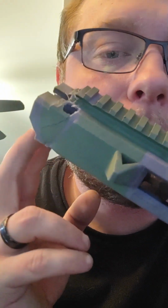But also, I don't know if JB Weld is really supposed to be bonding 3D printed plastic to relatively smooth aluminum under repeated shock loadings of 5.56. Adhesives generally don't perform well under repeated shock loadings. They have a tendency to fatigue. Though I would think that given the layer lines nature of a 3D printed component, adhesives, glues, and epoxies would do really well for those sorts of materials. You can kind of see the layer lines there. Layer lines give you little grooves that the adhesive can move into. So it's sort of like roughing it up with sandpaper.